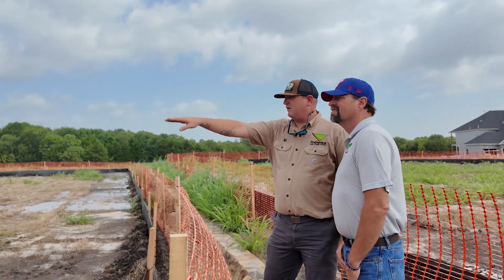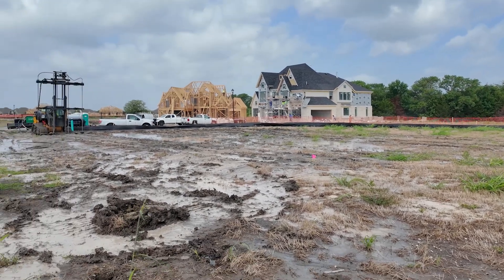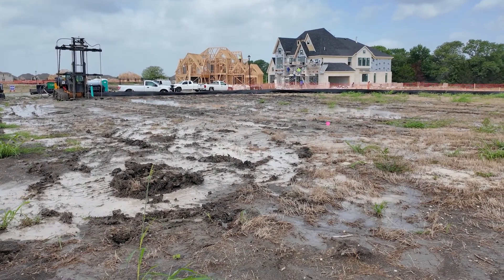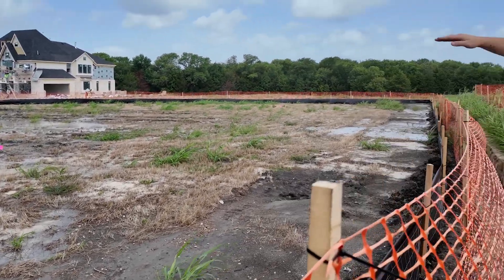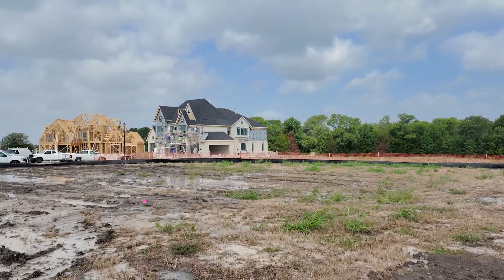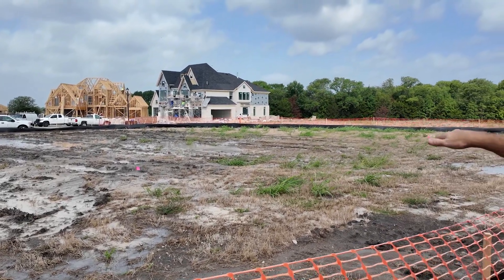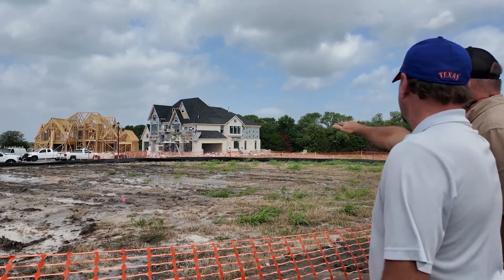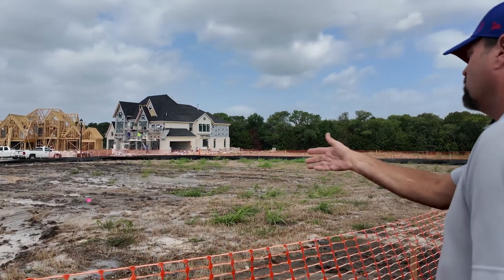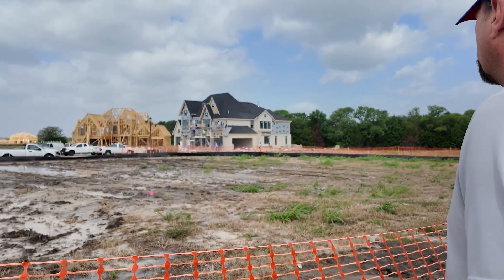As you can see right here on the first row that we've already injected with soil stabilizer, it's already heaving up and swelling just from the first row right there alone. It will continue heaving and swelling as he works his way across the pad. He's doing a good job of the injection. You can tell where the grassy area is where we have it injected — it's a little bit lower. Then you come in with your first pass of water and you see how it's lifted up amongst the grass. Then you come back with your soil stabilizer on your second pass and you see it swelling and activating into the ground.